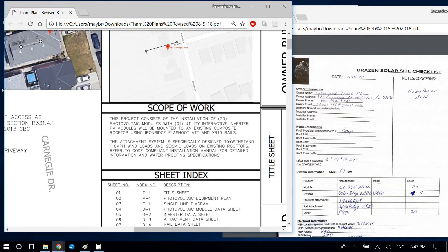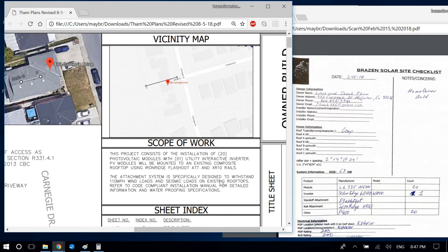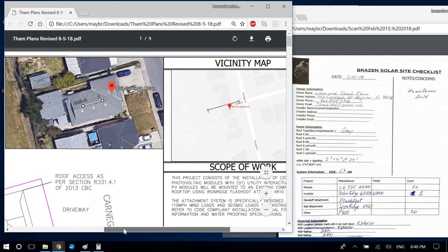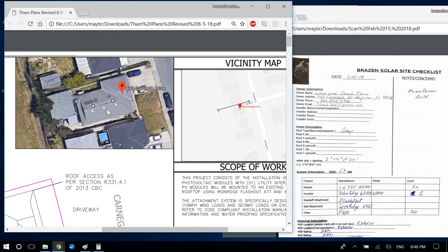There's always a structural wind speed note here. In Florida it can go up to 180 mph, so check your jurisdiction's requirements. The vicinity map is good — I would zoom in further so you can really see the property line. Make sure to capture that measurement, 124.38 feet, because you draft the property line based on that. You have the whole property line in the JPEG and a measurement to scale by — that's very good.